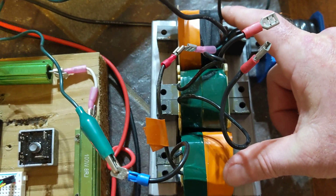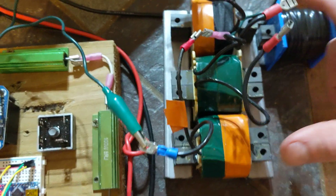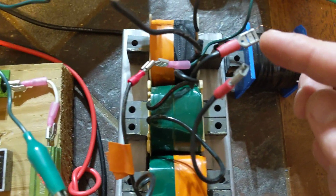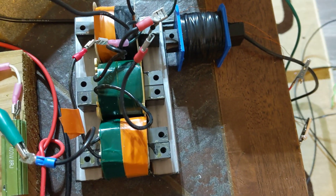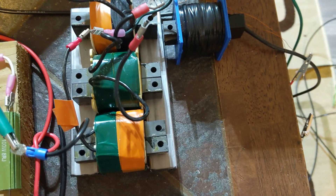These two outer ones are the drivers. These two here are the pickup coils. Now this needs a lot of pickup coils because it's scalable, and every pickup coil you add takes more and more off the input and starts self-powering. So first of all I'm going to unhook the pickup coils totally — watch what happens to the amperage.